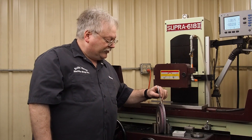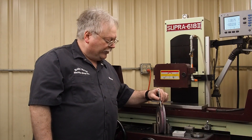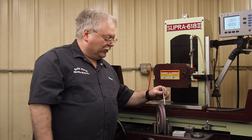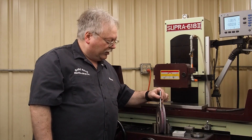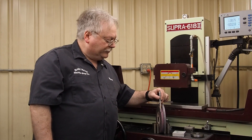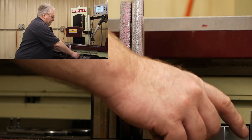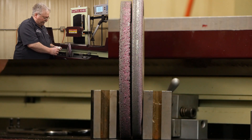But it's obviously a huge difference between the porous wheel and the non-porous wheel in how it loads. The load pattern on the porous wheel — you can see the loading right here. We're getting a little bit on the back side; it's dirty on the front but not a whole lot of loading. But when you come to this wheel, there's real heavy loading on the front and very little loading on the trailing edge. And of course, we didn't take as much stock off on it.